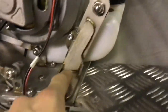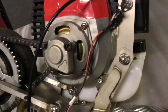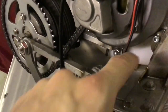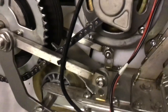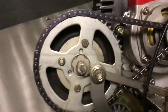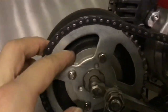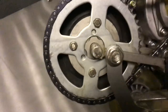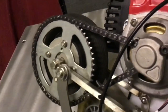And now this is the motor mount. It is made to fit the bolts on the aluminium housing of the motor. And then we have here behind some custom-made aluminium mud flap or dust cover, or whatever you call this. And here behind we have, of course, the rear sprocket, and this smaller round plate behind this is just an adapter, like a wheel spacer on a car, to change the whole bolt pattern. I had to make that to fit the sprocket on.